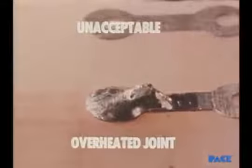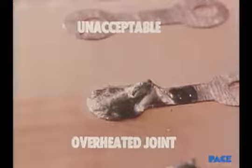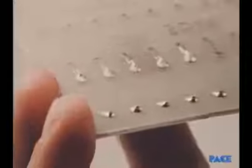It's often the result of repeated efforts to repair a joint that won't wet properly due to contamination or lack of sufficient flux. A good way to inspect the joint is to roll it around under an overhead light. The movement directs the light on every spot and will quickly reveal any pits or discontinuities on the surface.